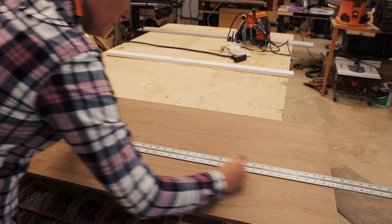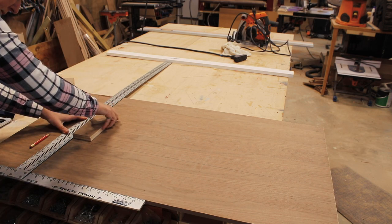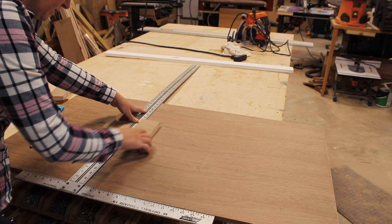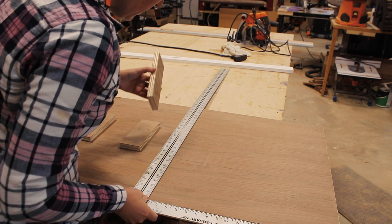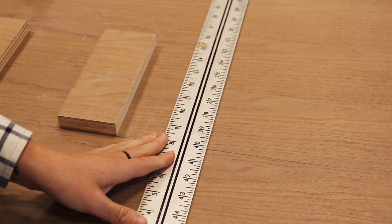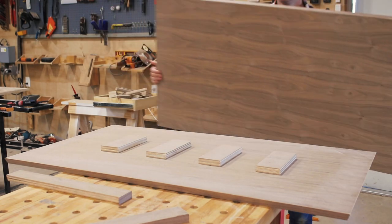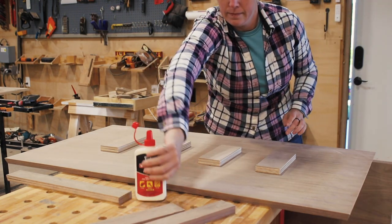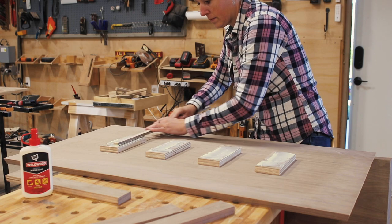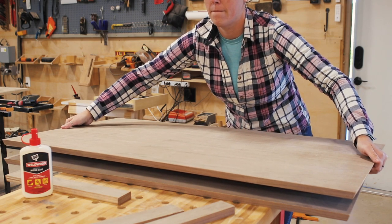Let's start with the top. To achieve the storage idea in the top I simply use two pieces with a gap in the middle. To create this gap I placed some blocks near the center. To avoid a long dry time I used DAP's Rapid Fuse instead of wood glue here. It's worth noting that since using the table I've changed the plans for these blocks to be one solid piece — smaller items can easily get lost and out of reach with the spaces.